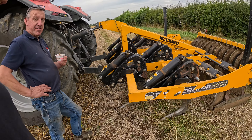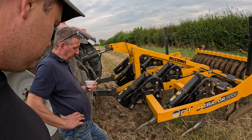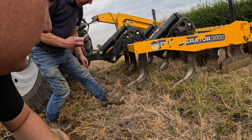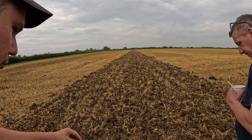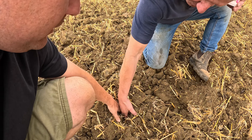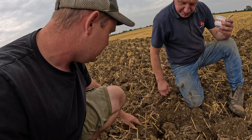Watch you don't fall off. On a dry year, that tool does just the same job as a plough in terms of loosening up soil — about 9 inches deep. The plough breaks the sub-soil at about 9 inches. Look at that — you dig right there, that's where you want to be. That sends the water where it wants to be; the plough breaks all the sub-soil, that's what they're doing. Last year when the ground was wet they tend to slip the ground up and lift and break it, but this is perfect the way it's breaking up here — last year we were doing this wet and it just doesn't do the same job.